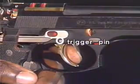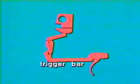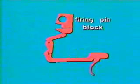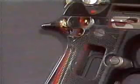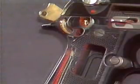Pivoting on the headed trigger pin, the trigger pulls forward on the trigger bar. As the bar is pulled forward, it pushes on the foot of the firing pin lock release lever. This forces the top of the lever to lift the firing pin block. As the trigger is squeezed, the mainspring expands, pushing the hammer forward.